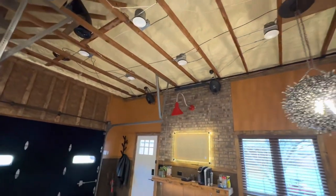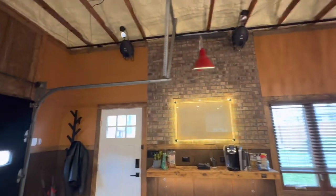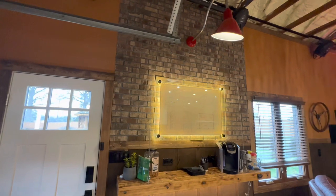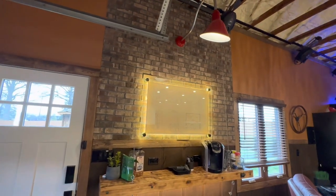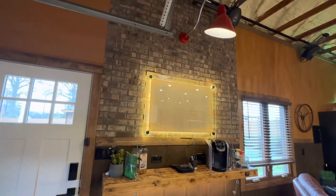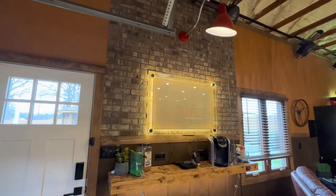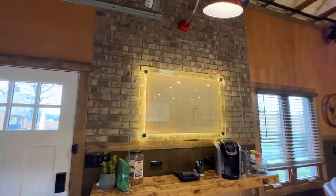Moving from the top to the bottom — I've got this really neat brick wall here. I found somebody getting rid of a bunch of brick on Marketplace, took my tile saw and sliced each brick like a veneer, and laid each one. I took maybe a week, laying a few each evening. It was before I had the HVAC in here so it was really cold, but I took my time, mortared them up, and it ended up being a cool feature wall.